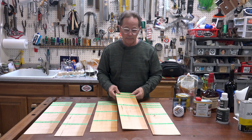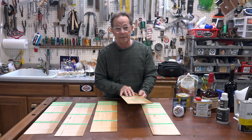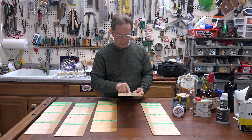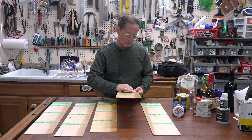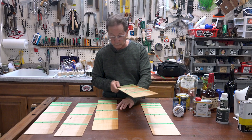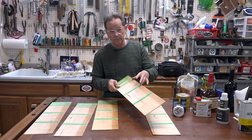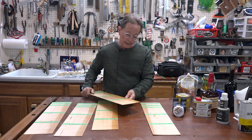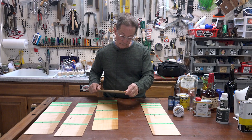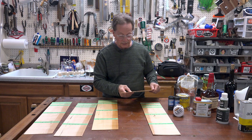The oil varnish blend is getting to be quite a bit better. By itself with no wax or Carbon Method over it, it's really not that good — there's a pretty distinct yellow stain from the wine, a little discoloration from the whiskey, the grain is slightly raised, but not as bad as the Osmo or the Rubio. The waxed section didn't fare very well either. On the other hand, the area with the Carbon Method ceramic over the top of it is absolutely perfect — no hint whatsoever of any chemicals. Just wonderful.